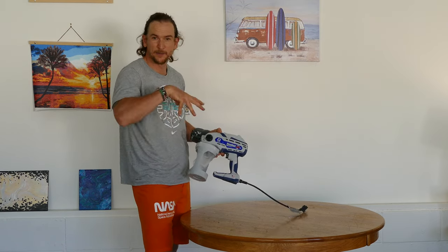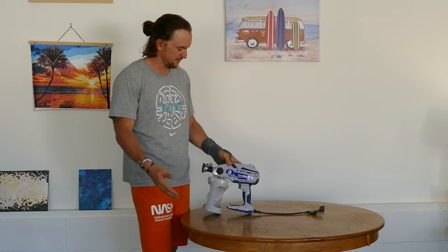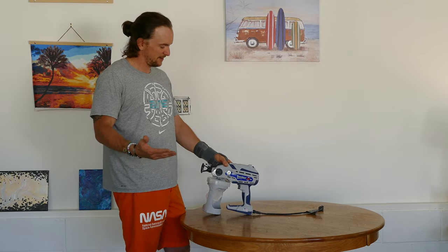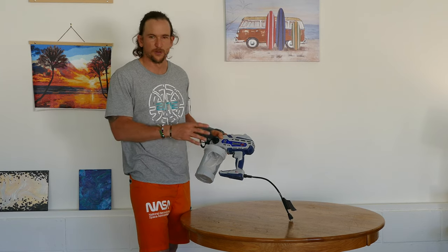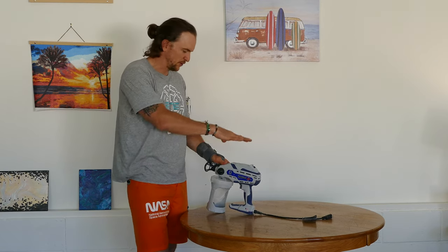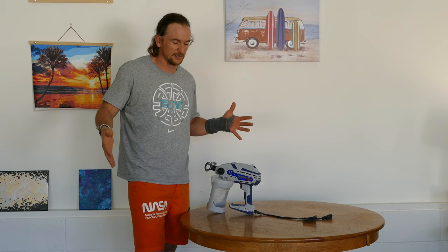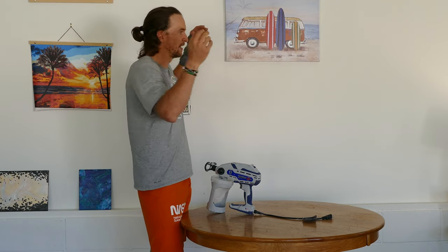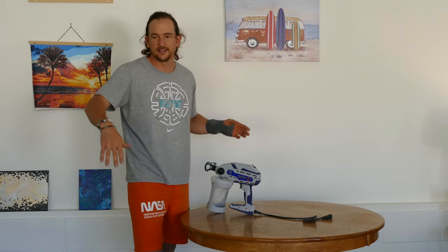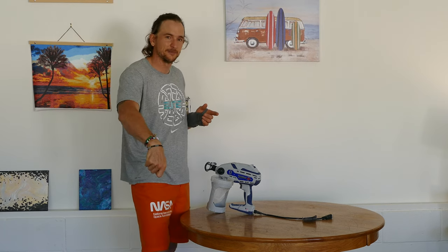It's just a flaw of handheld sprayers — nothing against the Graco TrueCoat specifically. It's probably true of all handheld piston sprayers. This is really a touch-up gun. I don't think it has a lot of uses for the homeowner. When you're looking at roughly $250, you can get something like the Graco Magnum X5 for about $270 — a normal airless piston-driven pump with a hose. It's going to be lighter on your arm, you can knock out ceilings, walls, deck, fence, without that fatigue. It's just going to be an easier project overall.